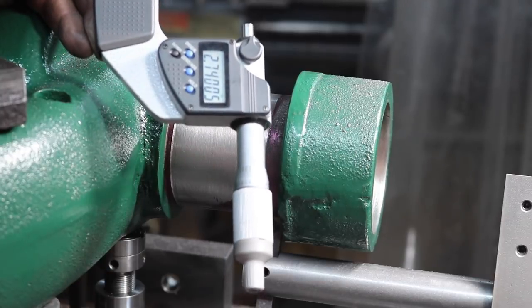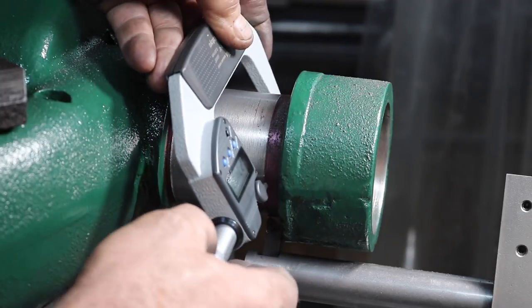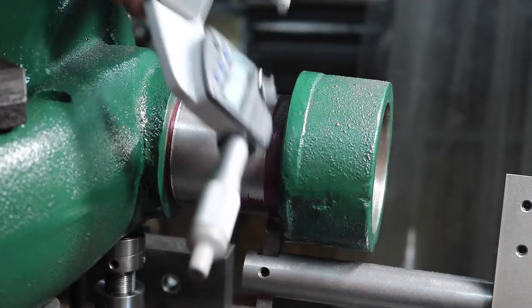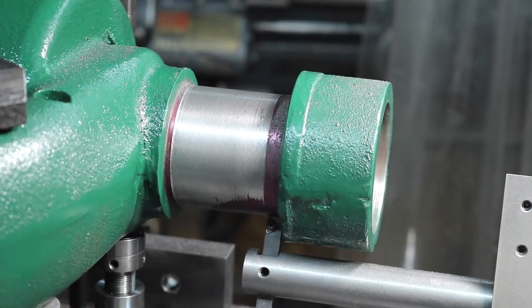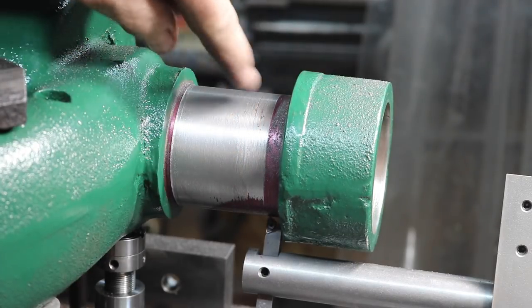.740. So we're nice and straight cut, boy. Actually, yep, 9/10 taper. So that's about 1/1000 taper. So that's not too bad. And we still can take off another 15 to be down to our measurement. So we might get most of this all cleaned up.